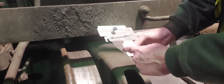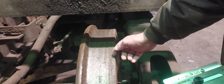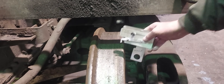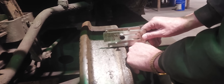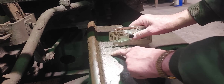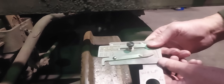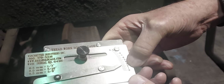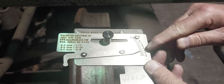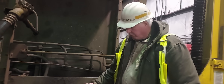You place this part of the gauge against the rim of the wheel. It has a cut-out to accommodate any metal flow that sometimes comes over the edge of a worn wheel. Then you hold it, slide the slider back and forth, and push the lever down to find the maximum amount of tread hollow. On this wheel it reads about 2.5 millimeters. The condemning limit is four millimeters, so this wheel is in good shape and should still provide decent steering in curves.